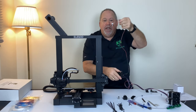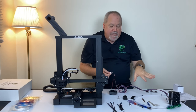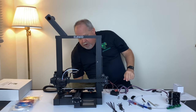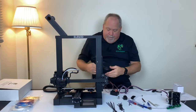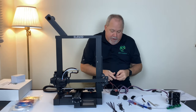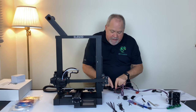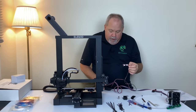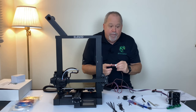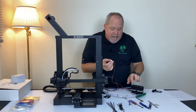The first thing I want to do when I get this out of the bag is simply test it to make sure we're good to go. Let me grab a power cord and plug this in. When you plug this in, you should see a green light come on inside the box. With the green light on, I can press the switch and see a little red light come on. If I press the switch for one second, we should see and hear the 3D Chameleon reset to color 1.